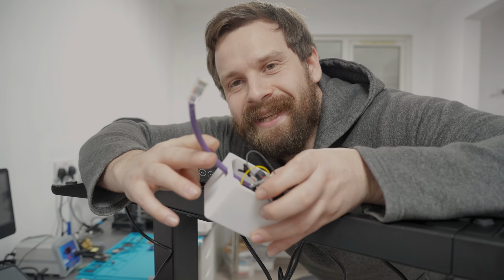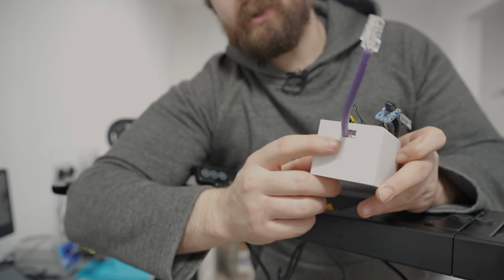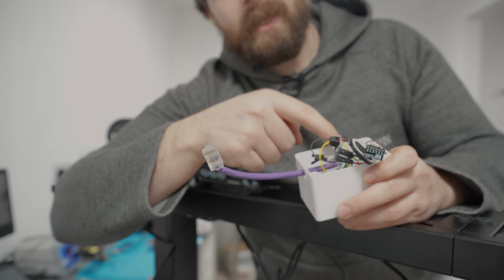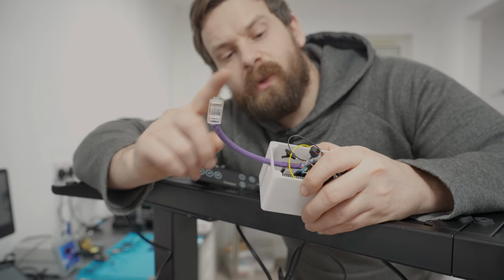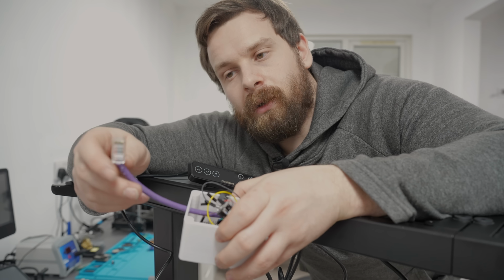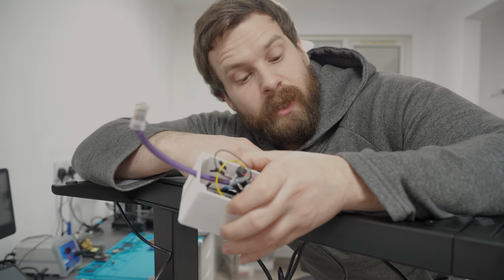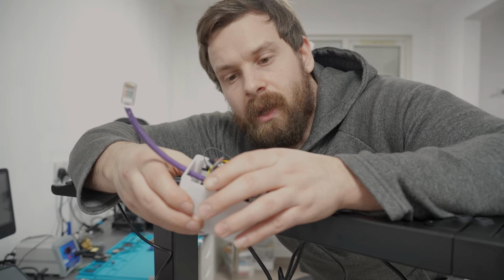And basically out the side, you can see that I just cut up a little Ethernet cable, ran it out of the side of the case. It's got our RJ45 end, and connected them onto DuPont wires onto the S3 also. And basically all that we need to do is to load our ESPHome firmware on here, which I will put down in the description if you want to follow along or see what I did. And then we just plug in the other end to the secondary controller port on here. It gets power, data, serial, all of that kind of thing. Put the lid on and yeah, we're good to go.